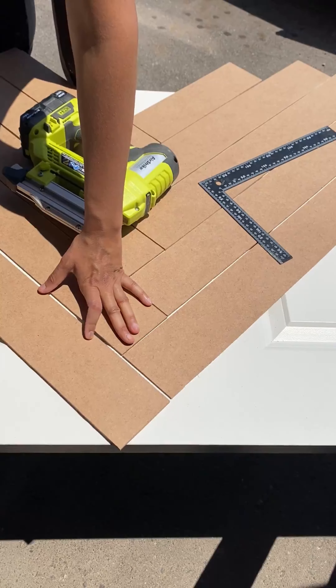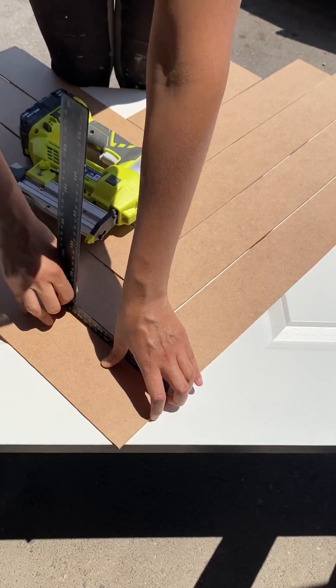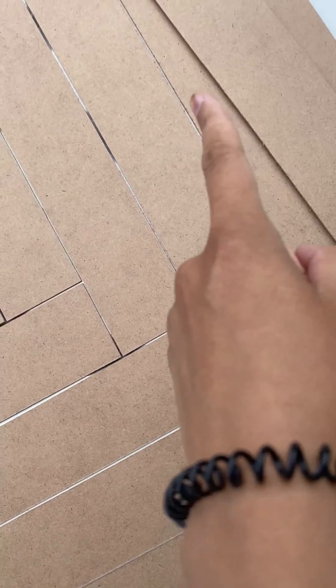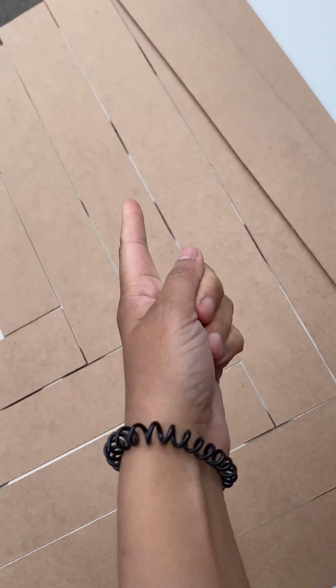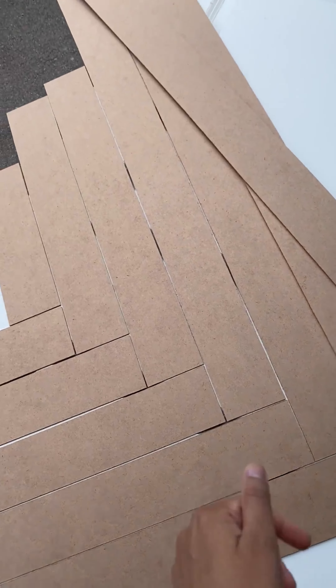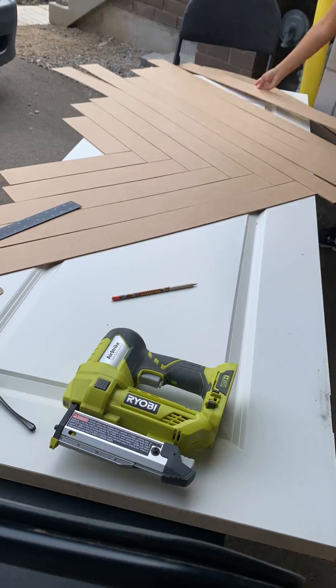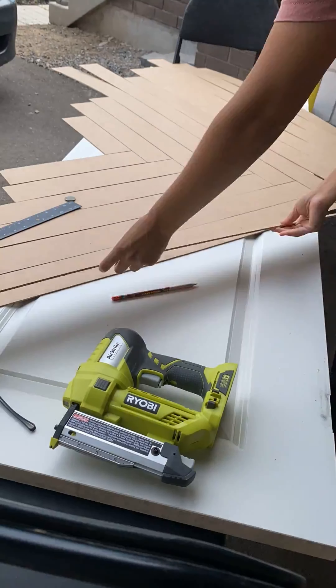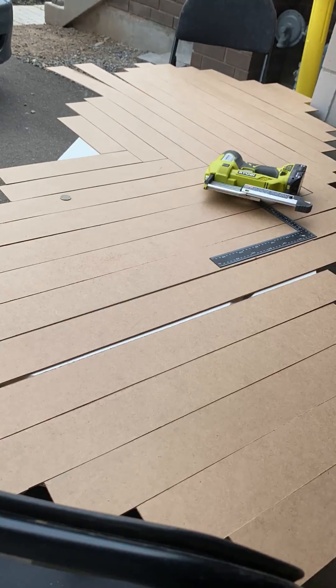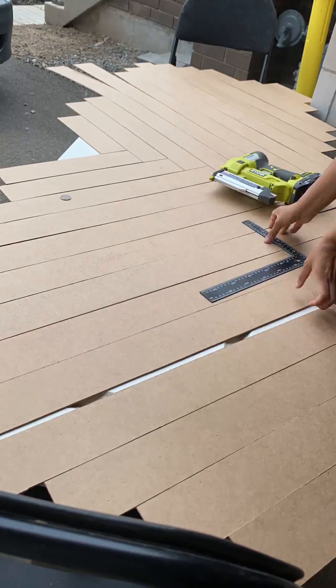I just continued repeating this pattern. It wasn't hard. You just have to make sure that the spacer is pressed up against both boards and you're nailing in. Go crazy with the nails. So you can see the gaps a bit here, but I think once it's painted it's not going to be a big difference because I'm going to paint a dark color. This is going really well and super fast. I love dry fitting the boards first — just making sure that my pattern is going to fit and I have enough boards. But anytime a project is going really well and really fast, you know something is lurking right around the corner that's just going to mess with your head.